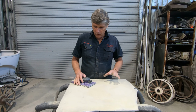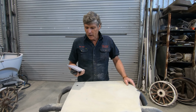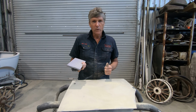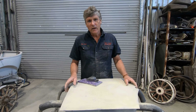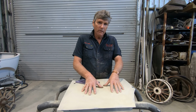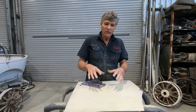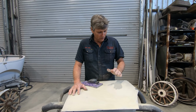Now with this car, I'm going to do a spray polyester layer over the whole thing, and it's like a sprayable body filler. But I'll rough that with 80 grit, and then I'll do a fine cut after a guide coat with a 180, and then my high build primer that goes on top of that doesn't actually have to fill any big deep scratches. And the reason that I'm chasing it like this is that all of your product will shrink. This body filler will shrink a bit, the polyester will shrink a bit, but once you get to the primer layers, they will shrink more than these will. So we've given this time to cure. This was done yesterday.